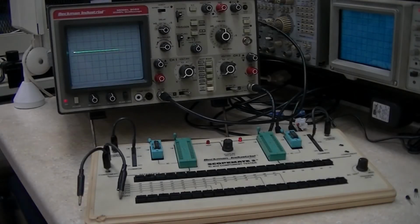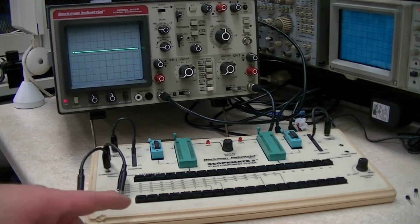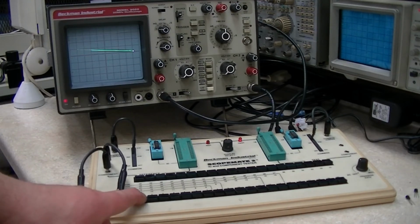Okay, I'm not going to edit the previous section out because, hey, let's make it reality, right? Because sometimes you make mistakes. I didn't change the common jumper on the test one for this particular IC, which the common is on pin 7. I didn't realize that until I got to pin 7, and I had 2 different readings. I'm like, what the heck's going on here? But let's go through that test again, and like I said, I'm not going to edit out my mistake because, hey, keep it real, right? But anyways, we'll do this again.